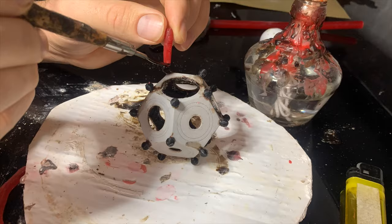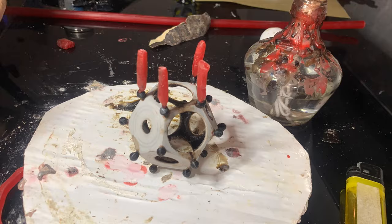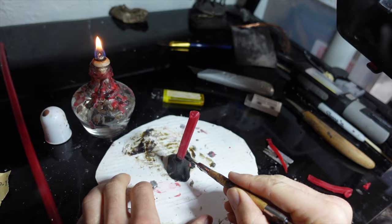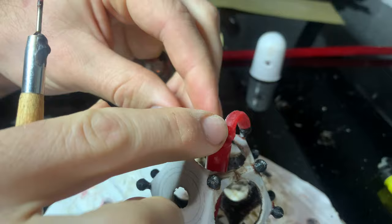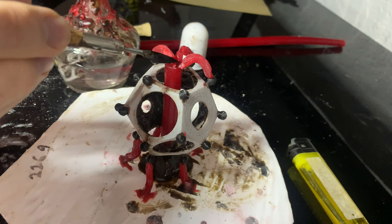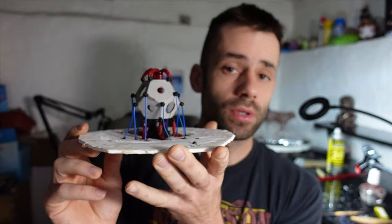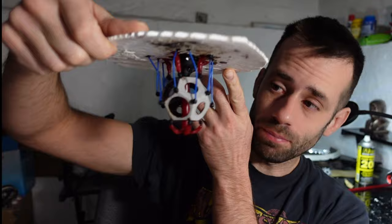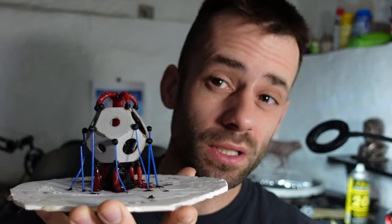So it's waxed up and nubbed up. Time to get it sprue'd up. How would an ancient Roman do that? I may not have the precision of the ancient people but I create my own style that sometimes works. I figured I'd have the metal flow from the bottom up — it's usually the best way to decrease metal turbulence and get a high-quality casting. I'm not sure if that's how the ancient people did it, but it's all sprue'd up. It's gonna be oriented like so. The metal will come in up the bottom, everything's vented — I don't think it needs to be because I'm gonna vacuum cast it — but just in case, and the vents will also help me blow all the ash out because PLA doesn't burn out perfectly.